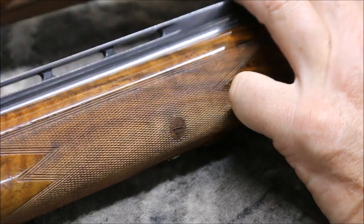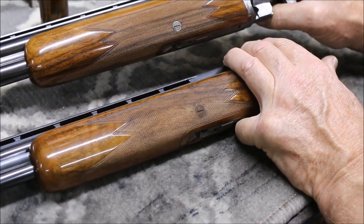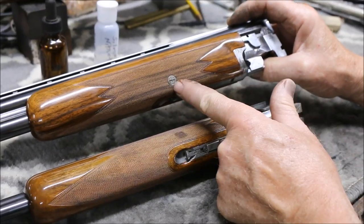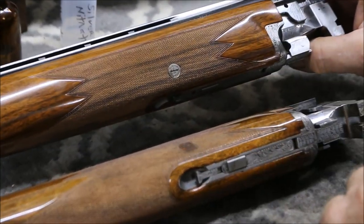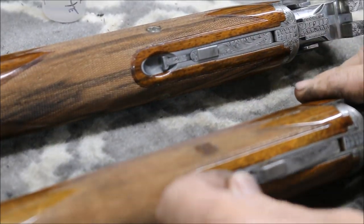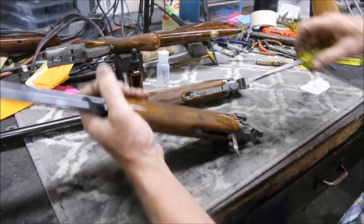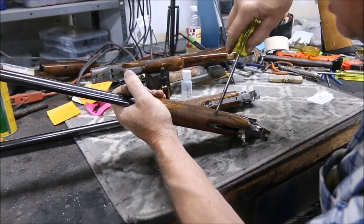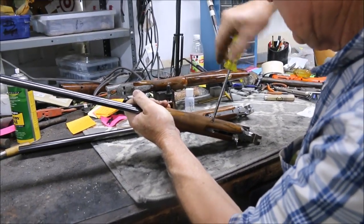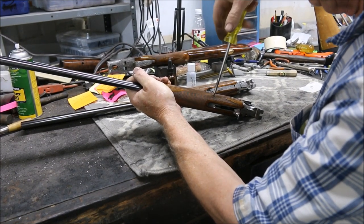Here's a good one. I've previously checked these guns and pulled them off before I made the video to kind of look at them. This gun, as you see, has no rust here, most likely it's not salt. The only real way to test them is to pull it off, do a visual inspection, and do a chemical test.